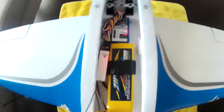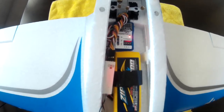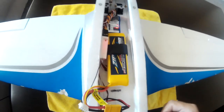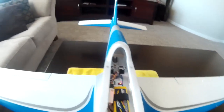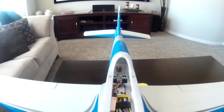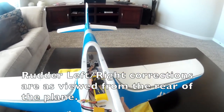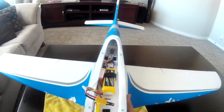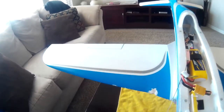The wiring is all tucked away inside, so instead I'll show you the control surface movement. With my gain knob turned all the way up, the rudder is the easiest surface to demonstrate. When I yaw the airplane to the right the rudder moves to the left, and when I yaw it to the left the rudder moves to the right. The ailerons are a little harder to see, but when you roll the aircraft the appropriate aileron moves up or down.